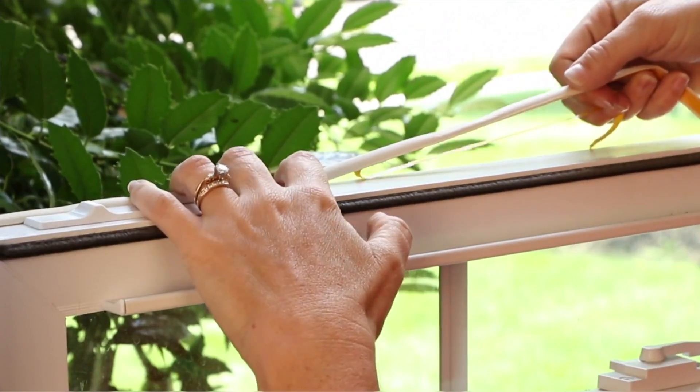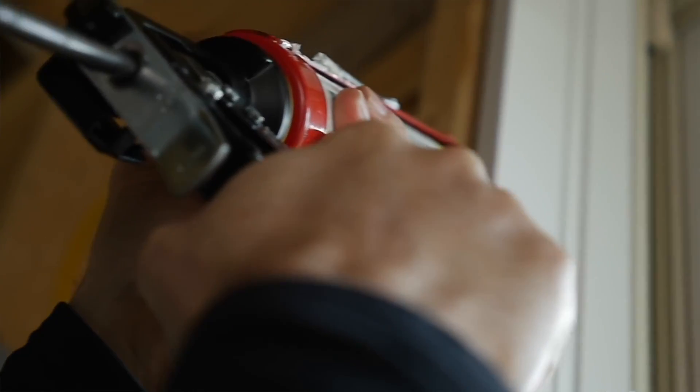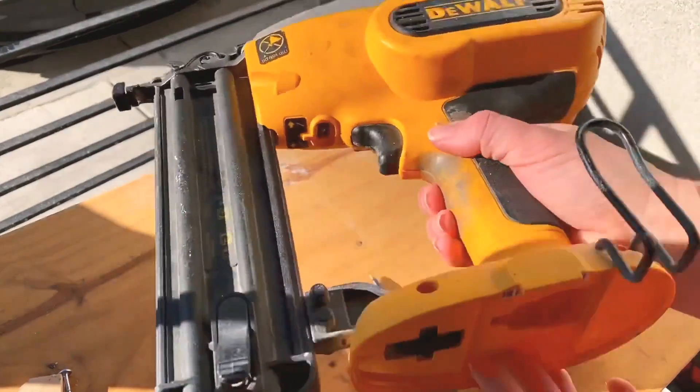Before you put the pane in, make sure the old caulk is completely removed and you have clean edges all around. Put foam window seal strip on the bottom to place the pane on top. Then put one layer of caulk in the frame on the outside of the pane. When you put the pane in, you want caulk and shims ready — especially if you have a tilted wall like ours. A continuous caulk enclosure around the pane not only holds it in place, it's also important for insulation. You definitely want to avoid any draft whatsoever. To get the trim back on, a friend lent me a nail gun, which I found ideal — very easy and really fast.